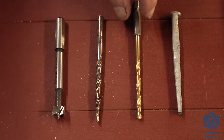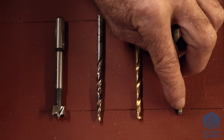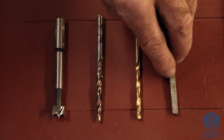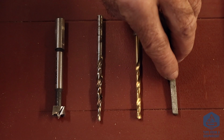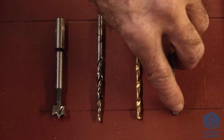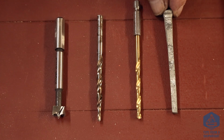And the other thing is, it's a little bit smaller diameter than this bit, and the idea is that the tip of this bit drills a hole just about the size of the end of the nail. And to me that's pretty important, because the end of the nail is cut, you can see it on an angle like this. If you left the hole that you drilled tapered and very small down in here, what happens when you drive one of these nails is the end of it starts to get unwieldy once it gets past the right diameter and starts to turn on you like this, and it gets hard to drive because of that angle that it's chopped off on the end. So you want to make sure you extend your hole down in there quite a ways so that it doesn't get bent on the end down in there, and that's why we use 3 bits.